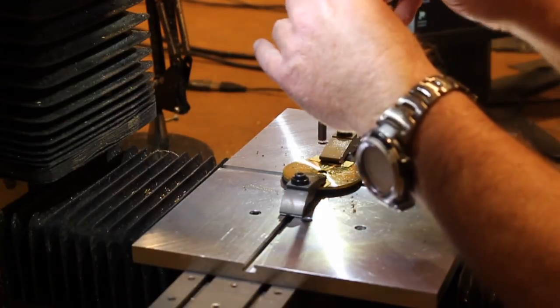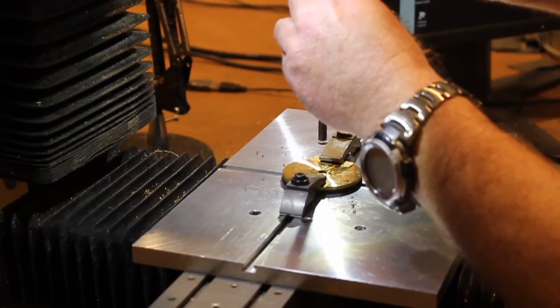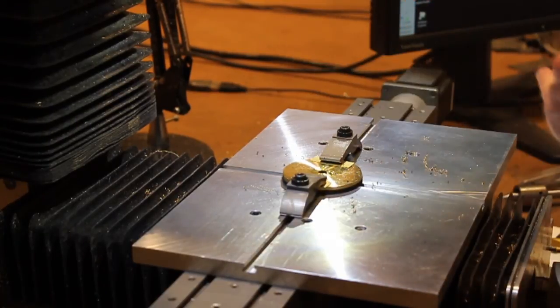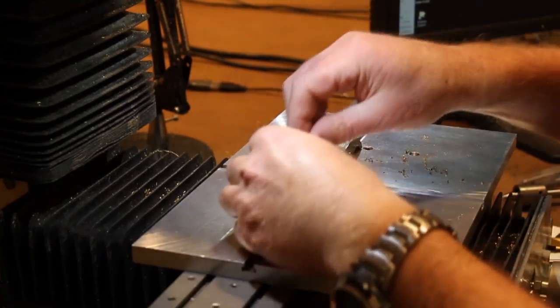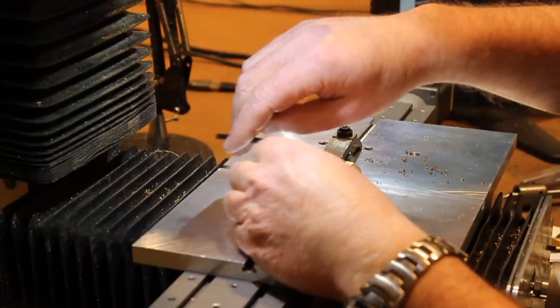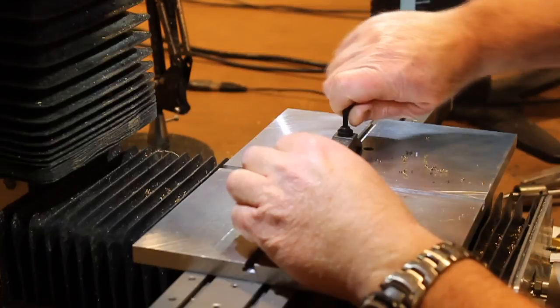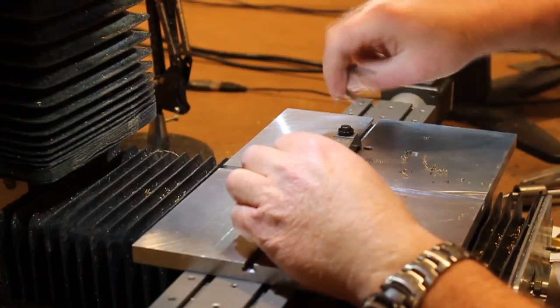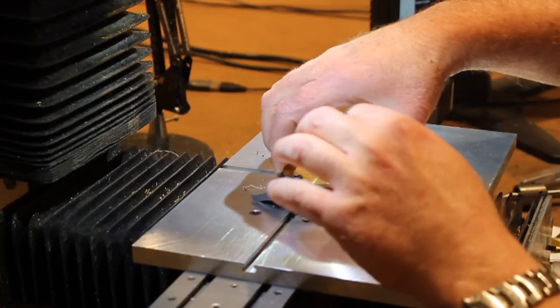That's the whole process. Of course it has to be done in each gear, but this gear now has exactly a 0.249-inch diameter hole in it, and later it will press fit and stay on a 0.250-inch shaft.